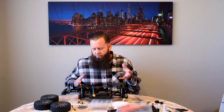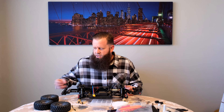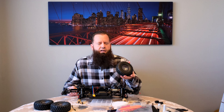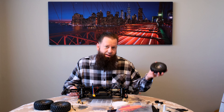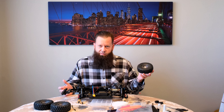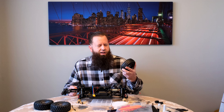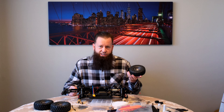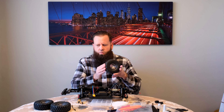Not just a pure crawler — because if you're building a pure crawler machine, you'd build it up differently. It'd be slower for one; you'd gear it down quite a bit. So anyway, this is a harder tire — it's not a super soft crawling-specific tire, but the price is good. They are bigger than stock, and in the real top truck competition, the guy with the biggest tires generally wins because you roll over things smoother. These are a 4.75 inch tire versus the stock 4.65, and they're also a little bit wider — so they are noticeably bigger, but not a really soft tread.